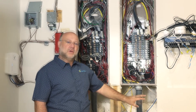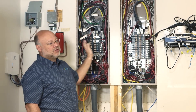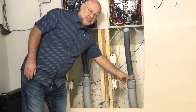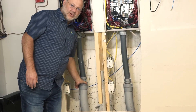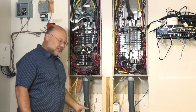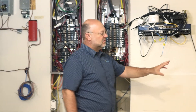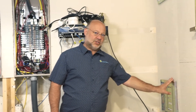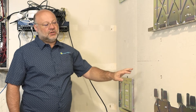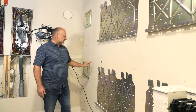We're not going to bring out a sub-panel and do sub-loads for the house. We're going to do a whole-house backup in two service segments. We'll be changing things by moving these service conductors over to an Ensemble switch — I have two switches — and from each switch we're going to put 10 kilowatts plus 10 kilowatts of battery into each switch.